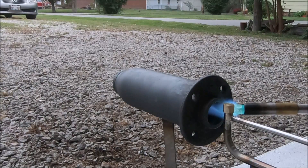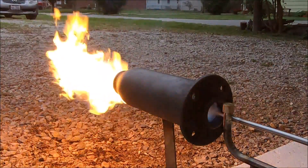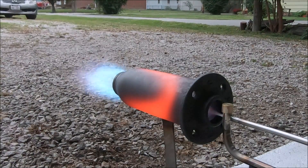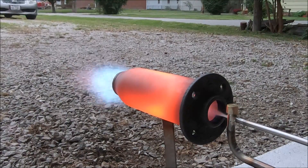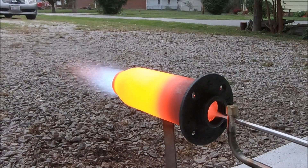There is no real observable difference. When you're looking down at the jet from the top it kind of veers off to the left a little bit, and I think it's because the orifice is off to the left a little bit and the air currents flying around the tubing from the Venturi effect is causing an air blast to push the fuel in that direction. Very minor inconsistencies in your nozzle will alter the shape of the flame and wave the fuel. What I do is listen — the best sound is how I know it's dialed in right.